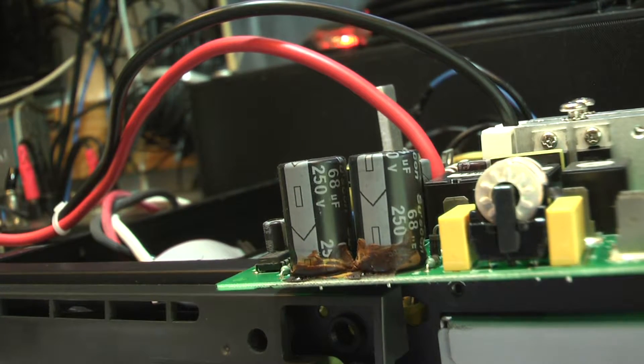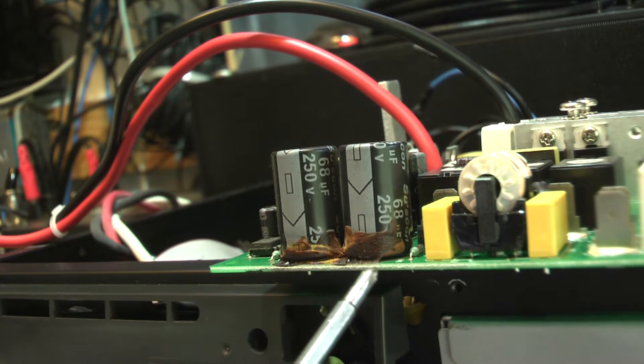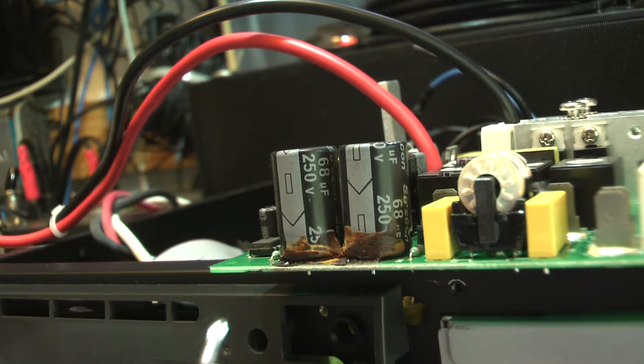Here's a closer look at what I was talking about that I noticed while it was still in the case. I saw this black and yellow — or kind of caramel-colored — crusted stuff around it. I actually don't see a penetration point or anything busted yet, and there's none of this on anything else on the board, on any of the smaller capacitors or anything else. It honestly doesn't look like any kind of glue because there's no kind of pressure on it. My next step is going to be to unsolder these capacitors and see if I have some sitting around anywhere, and see if replacing them makes any kind of difference. I don't like the way those look anyway, so they probably need to be replaced regardless.